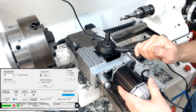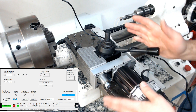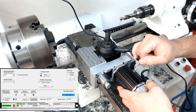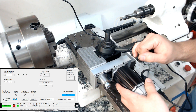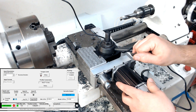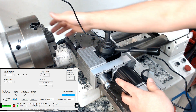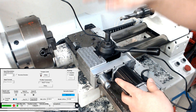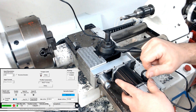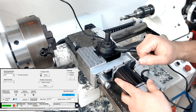Why would I need this? Well, basically, when I turn parts I do many things like hubs that hold bearings and flanges, and you always need some kind of holes — off-center holes, hole patterns, flats, and so on. I don't have a really good mill right now. I'm going to upgrade very soon to a bigger mill and do another CNC retrofit. The point is, I didn't want to unclamp the part from the chuck so I can do it all — holes, flats, everything — before removing the part. The aircraft parts need to be accurate and light, and I also want to do some light interpolation milling to make cutouts. That's why I have this spindle.